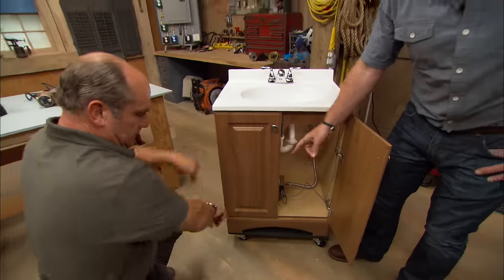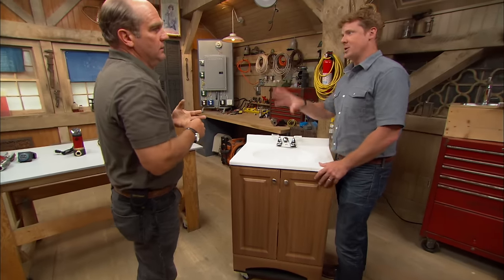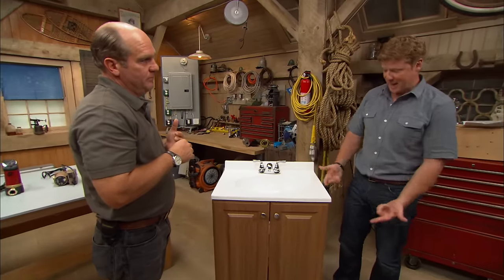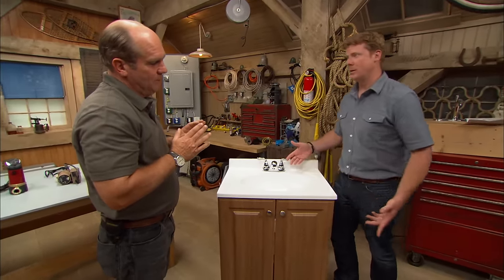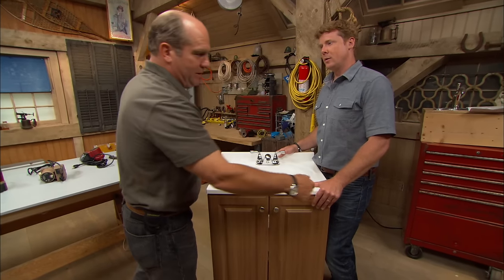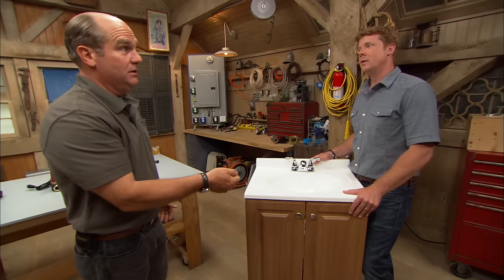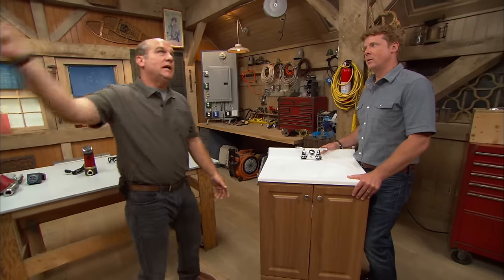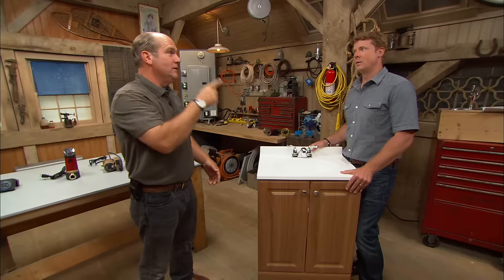So when you install the pump at a faucet versus down at the tank, does that mean that's a single point of use device? Because, I mean, I have to stand here in the morning, walk in, push the button. Well, it is, but it isn't. Meaning you could make it be a standalone with that button, but they also have a wireless unit that can bring it on, so you could be in another bathroom and make this thing come on. And once we've established flow through here, all the bathrooms off the line would get hot water.